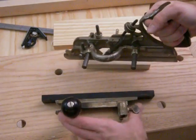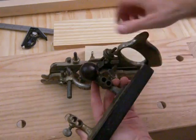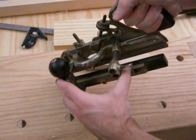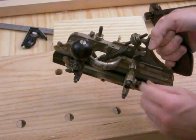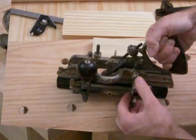And now you'll want to put the fence back on using these upper holes here, so these two up here, because we have to be able to clear this and get underneath it. And you can go ahead and tighten these down until they just touch and then back them off, because we will have to set that up later, which I will show in a second.